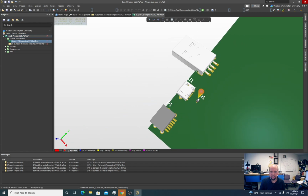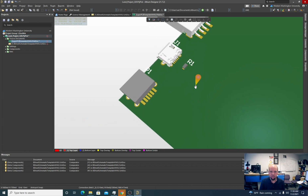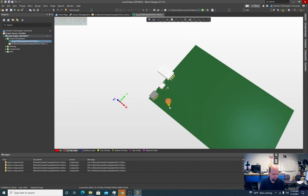The main thing is you want to keep parts kind of far away, because you're going to have to get an iron in there and it's going to be a pain. And you don't want to also deal with this. I deliberately extended out these USB-C pads, I deliberately made those longer. I thought I'd done that on the micro too, but I guess I didn't.